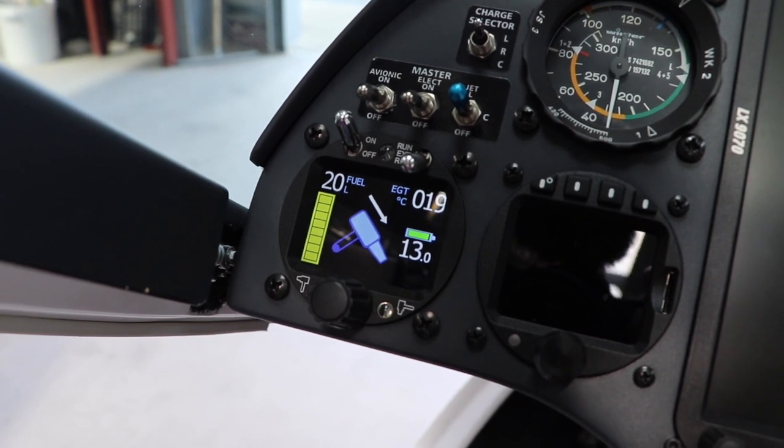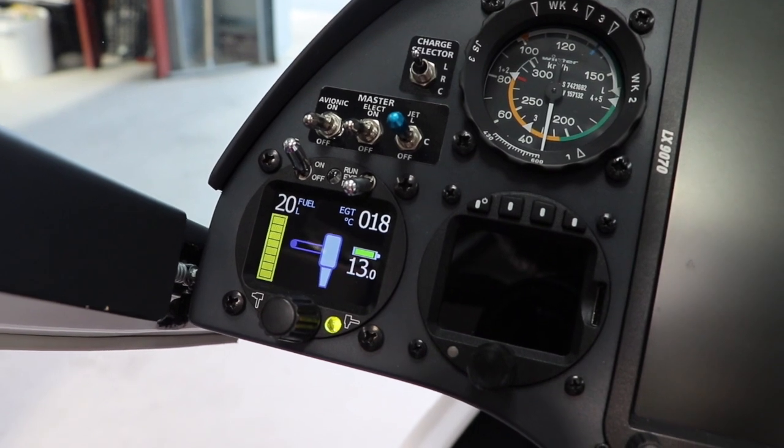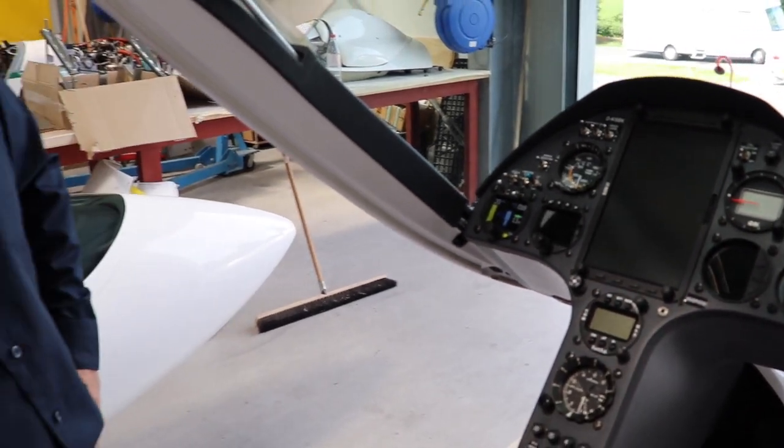It's a very simple process to follow. It takes about 45 seconds for the engine to start up from the moment you switch power on, but if you take into account that the rate of descent is not increasing at all — you're still descending at only 0.6 meters per second — it's just about 27 to 30 meters of altitude loss to start the engine in still air.